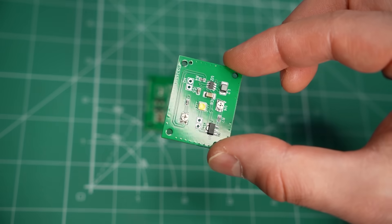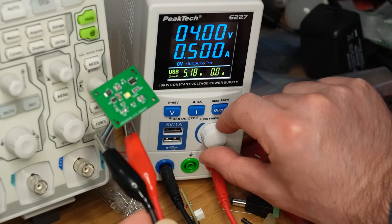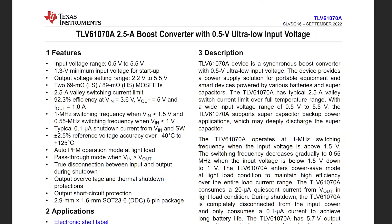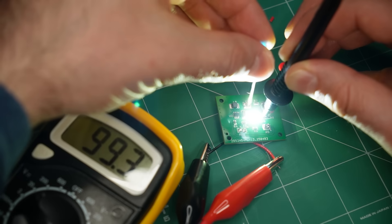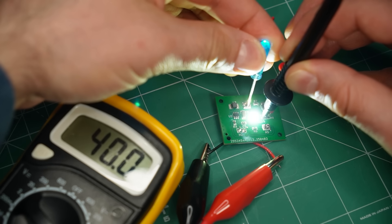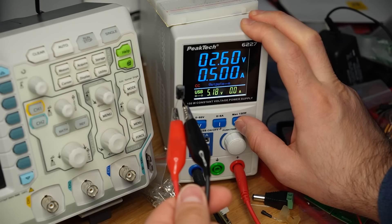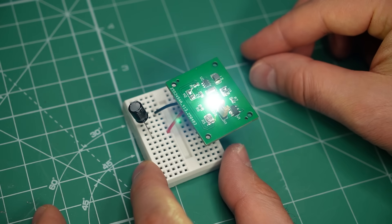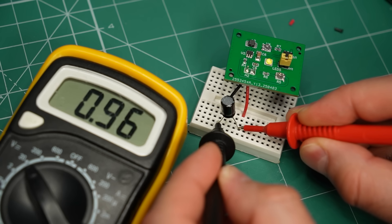Now comes the third stage in my circuit: on this PCB is a boost converter that increases the voltage from the supercapacitor to a usable level. For example, with my power supply set to 2V, the boost converter gives me 3V at the output. This voltage converter can work from as low as 0.6V on the input, which makes it ideal for supercapacitors. Its output goes into an LED driver and a surface-mount LED. Another potentiometer lets me adjust the current setting for the LED driver — I'm adjusting it to the lowest setting, about 33mA. I charged the small supercapacitor to about 2.6V and the result is about 12 seconds of light, after which the booster starts shutting down.